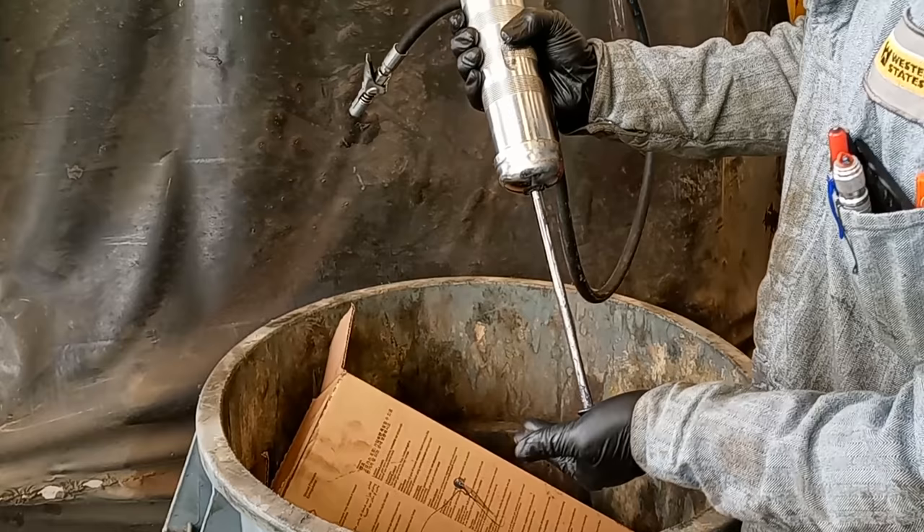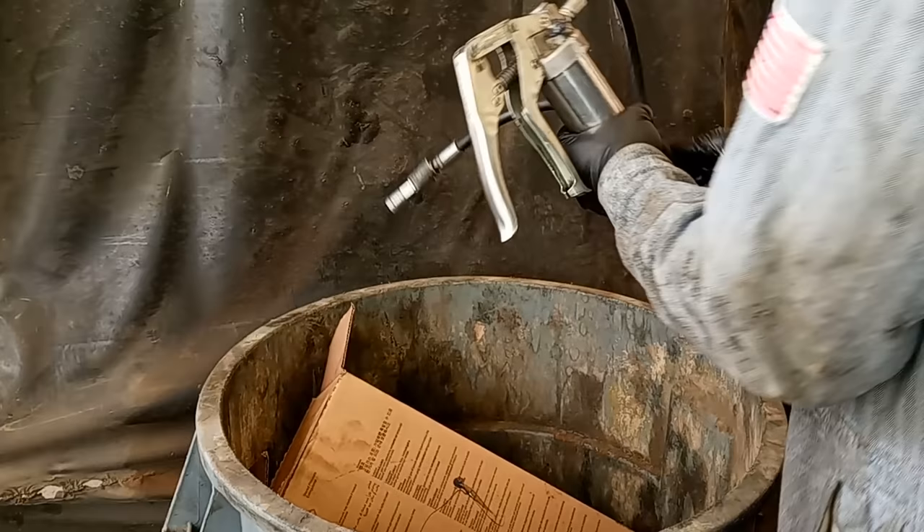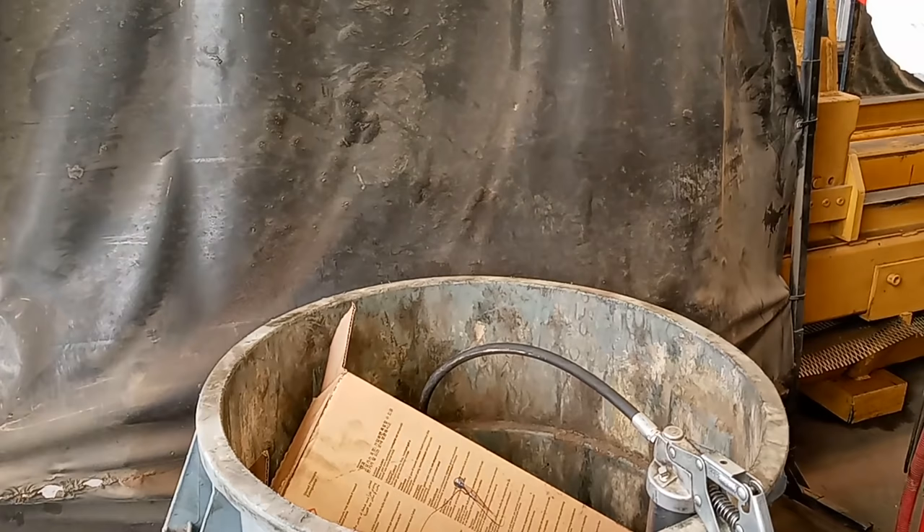So that's pretty much it: don't run it out of grease, install the cartridge upside down and purge the air out that way. If you do get an airlocked grease gun, do what I just showed you. Thanks for watching.